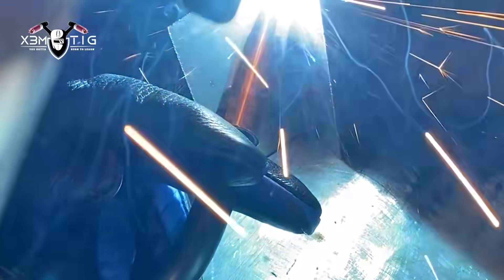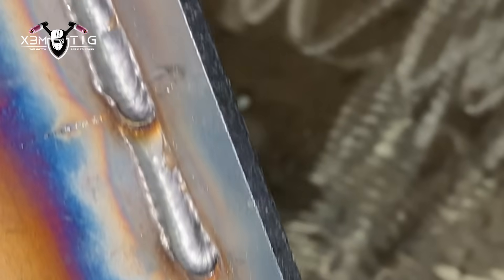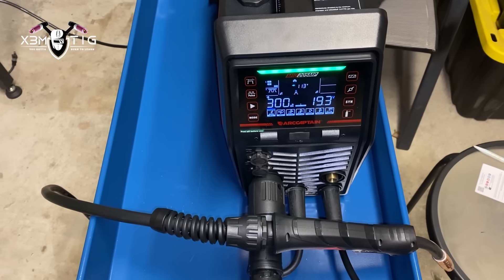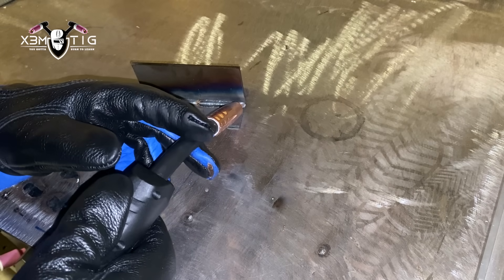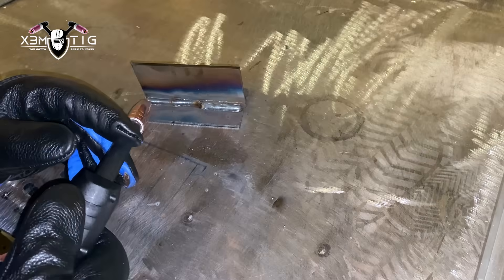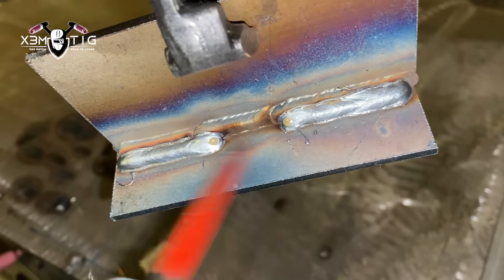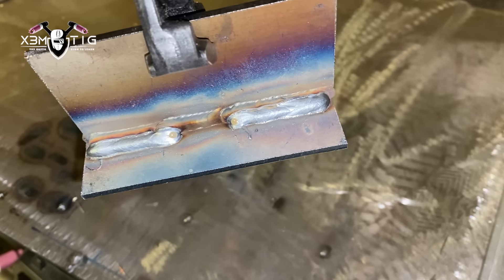It's pretty good — lots of function. I really like this welding machine, it runs really nice even on 110V. By the way, this MIG demo is on 110 — the plasma cutting and TIG were on 220. Absolutely nothing wrong with that for any hobby or small project work. Running hot here — there's no undercut on top, it really melts the base material perfectly.